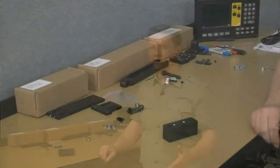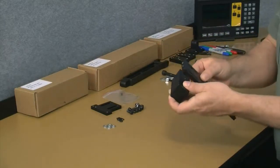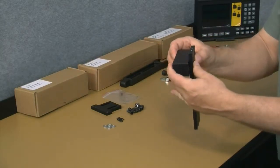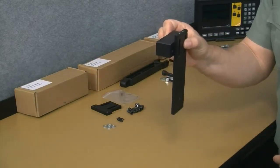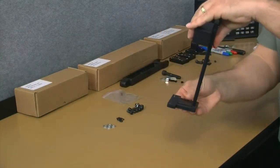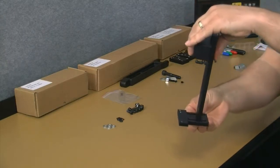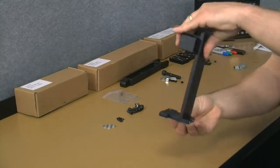Remember, there's no one particular way to install a digital readout. We also have this vertical adjusting bracket, which mounts to the back of the stop plate bracket like this. And we have the horizontal T bracket, which mates underneath the vertical adjusting bracket. Alright, so let's bring these parts over to the lathe.